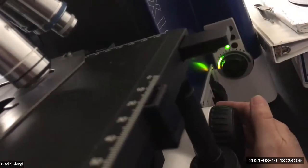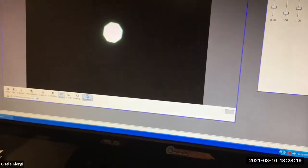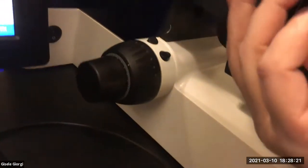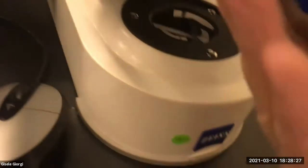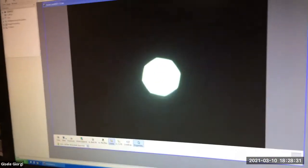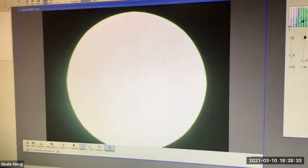It's a little wheel over here that I'm turning. But you stop down the field stop just because it's helpful, basically, because then you can see the column of light really nicely. And then you focus it until the edges are sharp. And then you play the centering screw game until, as I like to think of it, it's nicely centered,